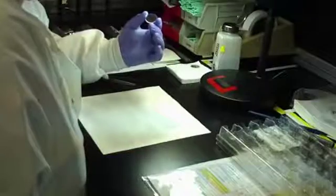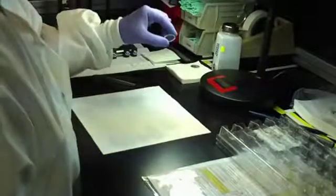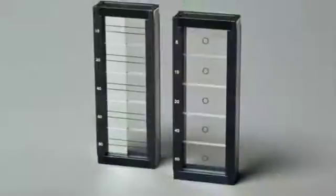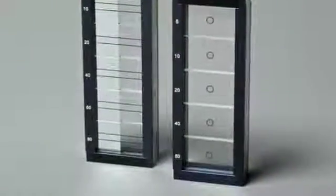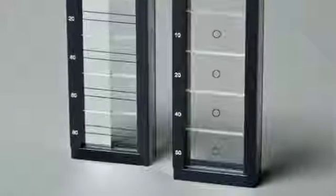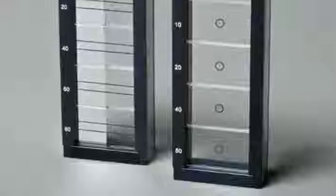As defined by the American National Standard Institute, either a 40-watt incandescent lamp or two 15-watt fluorescent lamps are used to illuminate the test units against a black background. Filters are inspected by eye and compared to the comparison standard. For all inspections, the parts are held under the lamp at 45 degrees relative to the associate's eye. Under these conditions, a visual inspection of each filter is performed, assuring that each filter is judged using visual defect criteria as defined by the standard.